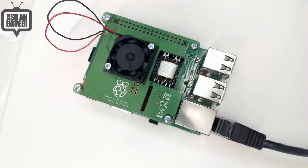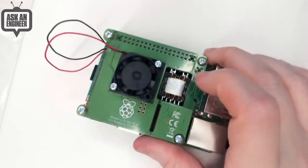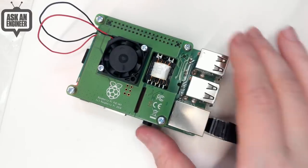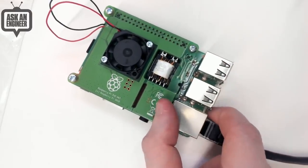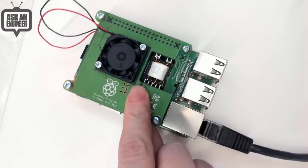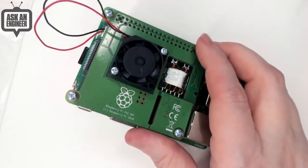With power plugs, cables are usually only about 3 meters long at most. The POE hat uses 48 volts over the line, which is then switched down to 5 volts safely going into the Pi. So this can be good if you want something 100 feet away — you can use Cat5 cables and you'll be able to power and do data. Wired Ethernet works great, and nothing really beats wires when you want a stable connection. This is the new updated POE hat — they had an earlier version, fixed a couple things, and now we've released it.